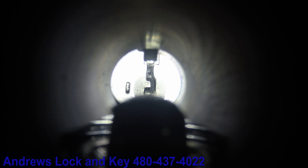Once you figure it out, you can make a key in about 30 seconds with a pair of clippers at the door. Again, we're looking right here at the wafer. I'm looking through it via my GoPro video feed on my tablet, so it's a bit grainy here — you guys will see it in 1080p. Looking right here, this cut I believe is a 2... actually, no — that's a 4. I apologize, I believe that is a 4. The best way to do it is to key up the lock to 1, 2, 3, 4, 5 so you can determine and scope the lock yourself and see how it actually works.